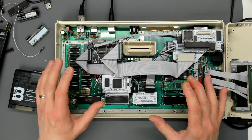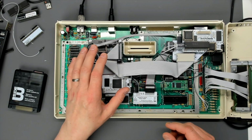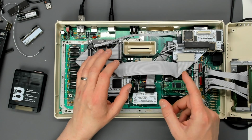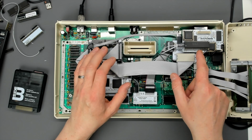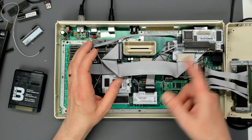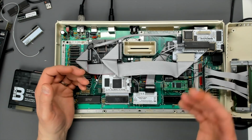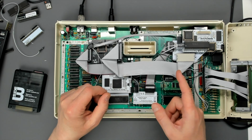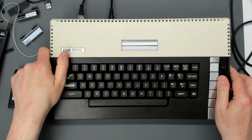I've made a few changes inside the machine again, just in one last ditch attempt to see if anything can affect the Rapidus reset issue. So we had the unwanted cold boot on reset in classic mode, and when Rapidus is entirely off the bus on this particular machine, it was hanging on a black screen. So what I've done is I've taken the DRAMs out of the board again. I've put the SRAM board back in the Rapidus CPU socket. I did even try an NCR CPU at some point. That made absolutely no difference whatsoever. But the SRAM board doesn't seem to do any harm, so I'll show you how it's working at the moment.